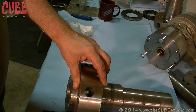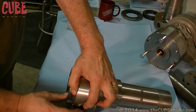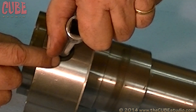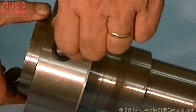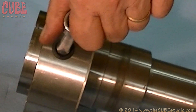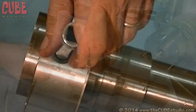This goes into one of the cam lock holes like that, and now you can see the spring. You can put this in from the front. See the little line? You can actually see it pop out — it comes around and it'll pop up. That's where the stud retainer hits the detent. This pops up, so now that will stay there while you're getting the chuck on and off.